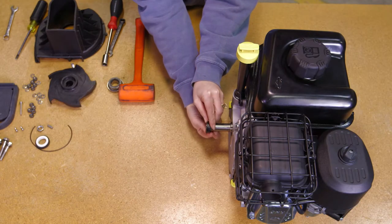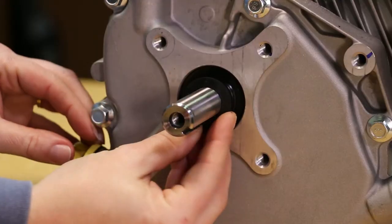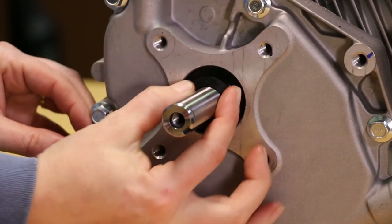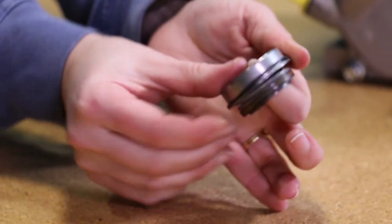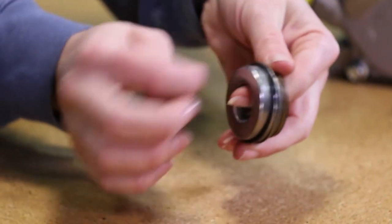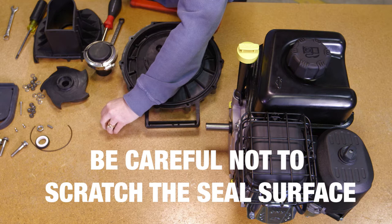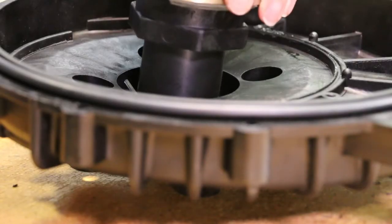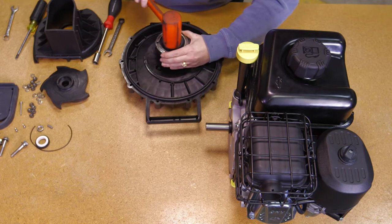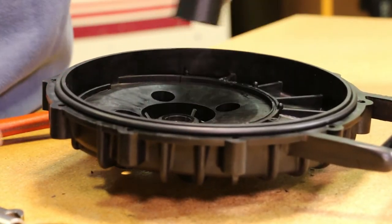Follow these steps for assembling. First, install the pump slinger on the drive unit shaft. The slinger should be slid all the way back on the shaft so that it covers the step on the drive unit shaft as shown. Place the replacement seal O-ring behind the lip of the carbon seal half. The carbon seal half should now be installed into the rear bracket using a tool such as a one and a half inch pipe nipple or arbor press to give even pressure on the metal flange of the seal housing during installation. Gently hammer the seal into position until it bottoms.